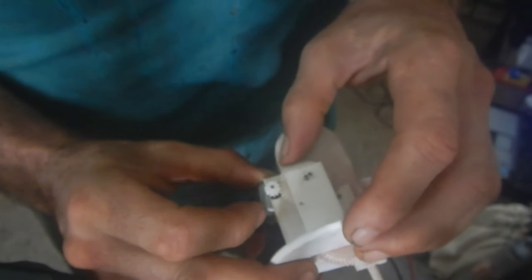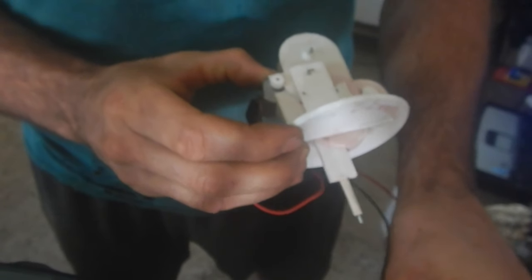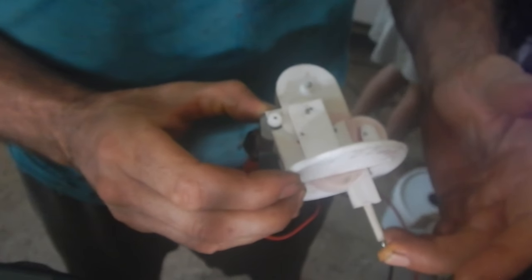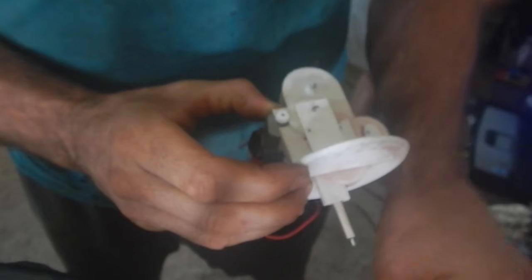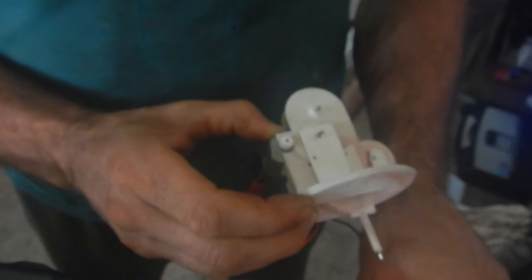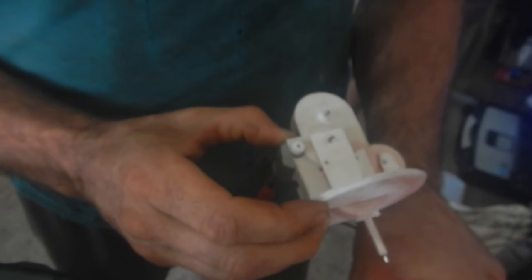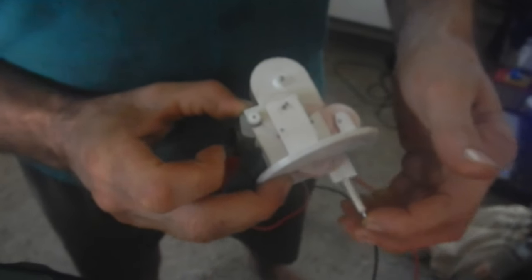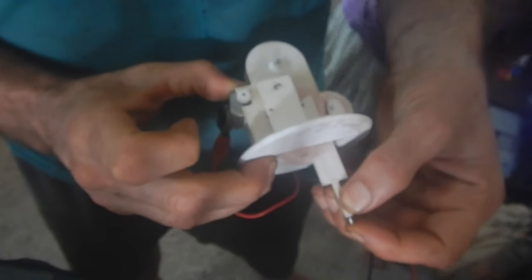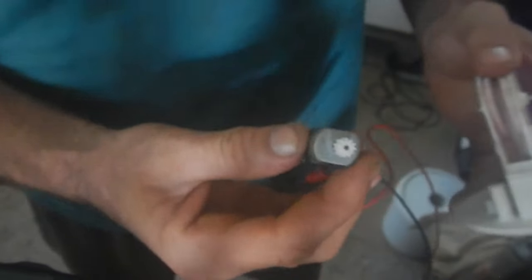Let's tip it a little bit so it's a little... let's get an X-bar right. Beauty, that was great. That's five volts right there. Yeah, that's pretty strong still. Six volts. That's pretty fast. I think this is like a five to six-ish volt motor. Yeah, I took out one of the gears — it should be somewhere around five times faster. Feels like it's still strong enough, even with this little motor. Good, I was hoping I could still use one of these little motors.